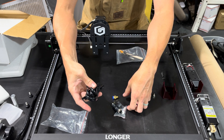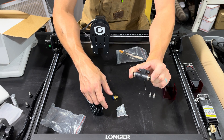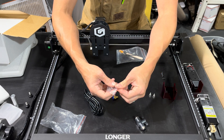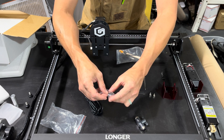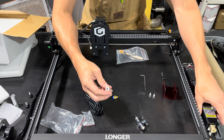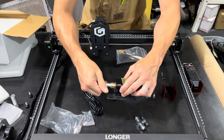You've got some goodies: your tubing, a little valve to turn it on or off. I don't see why you would ever want to use that, because you're going to want to use the max amount of air. A lot of times people will find it's still a lot of air, and they may want to add an air compressor instead of this little air pump, which will deliver a lot more CFM and air. Here is your little Air Assist head — kind of a cute little guy. You've got a little rubber gasket that goes in here, and you're really just going to thread it back on.